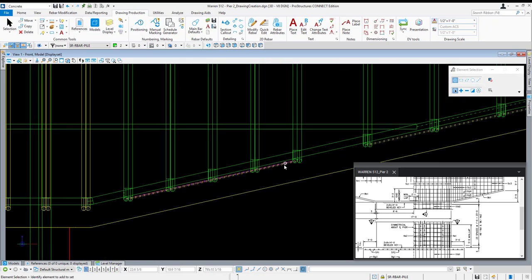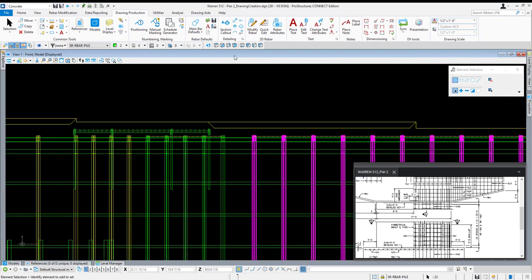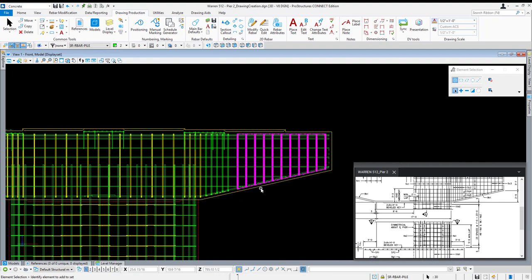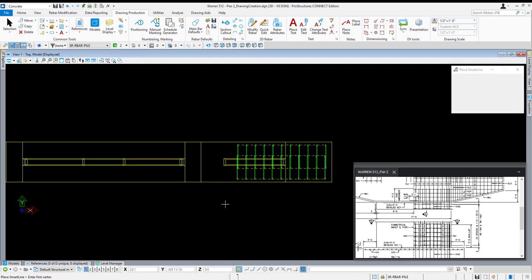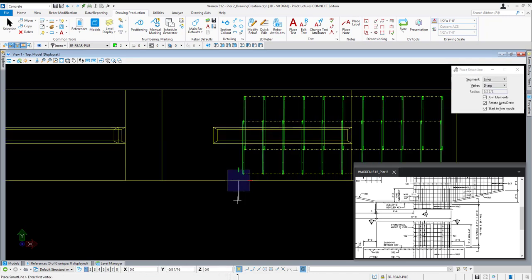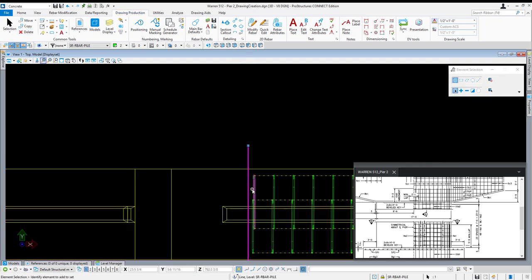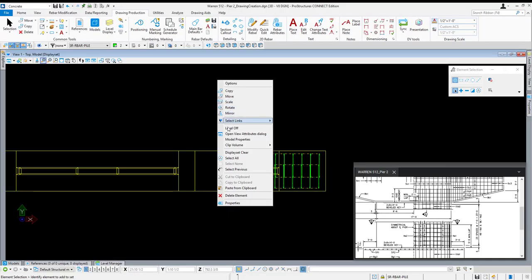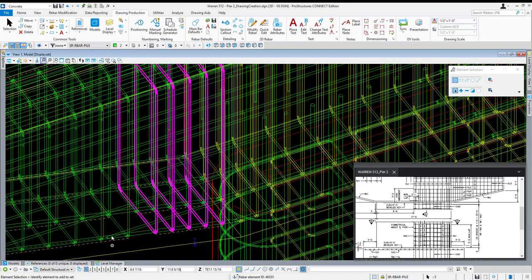I did create a second set of ties. I noticed that the 5C2s were actually at 6 inches followed by the 5C3s at 10 inches. To do that, I isolated the guidelines for the reinforcement and the bars themselves, using display set, rotated to a top view, then utilized guidelines with trim multiple — which trims and extends lines — and then using break element with the guideline as the break point, I was able to chop the lines into multiple pieces and create two separate sets with different spacings. Then I mirrored them to the opposite side.